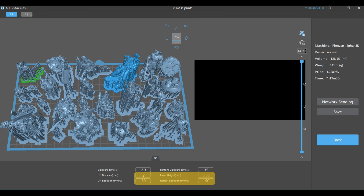The rest of the settings you'll typically leave at factory default, at least for your first prints. Faster raising and lowering speeds may reduce your total print time, but it could cause bad prints if it's too fast, due to not allowing enough time for the resin to resettle after the plate leaves the vat. Together, all of these settings — longer exposure times, further lift distance, and slower lift speeds — all grossly affect the time it takes to print a project.